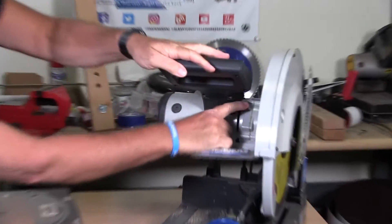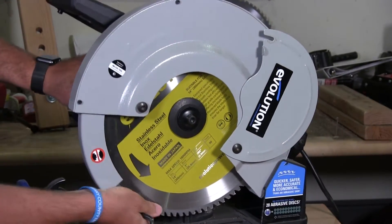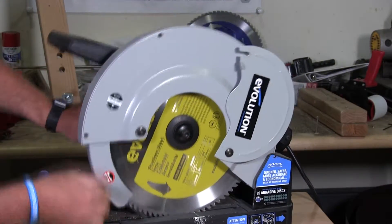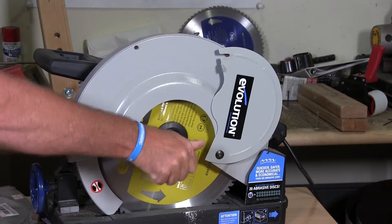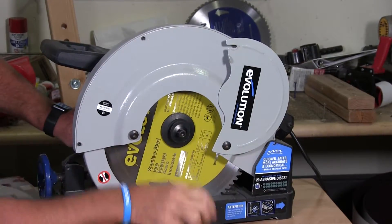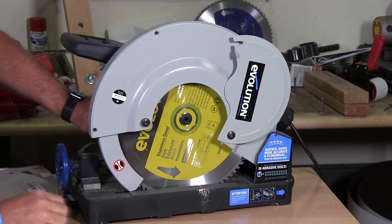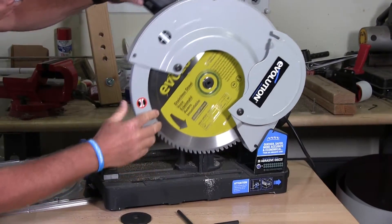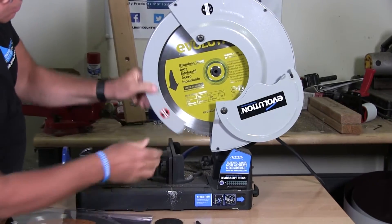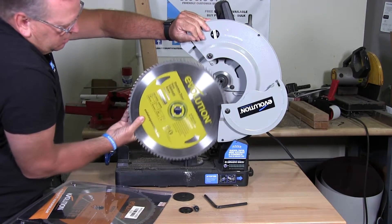On the inside here there's a little button you push down — that button, right there — you push it to lock the blade. You can see it's locked. Take my finger off and now you can see I can turn it; push the button down and it locks. Put the tool in, turn counter-clockwise, take it out. There's a washer, there's your screw. Pull that retaining washer off, let it slide up, then pull the guard up and slide the blade out.